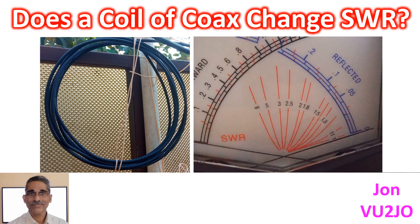I used two lengths of 10m HLF200 coaxial cable with PL259 connectors at both ends as the feed line. The two cables were joined together using an SO239 barrel connector. The surplus cable was placed in a U pattern on the terrace, almost at right angles to the antenna orientation.